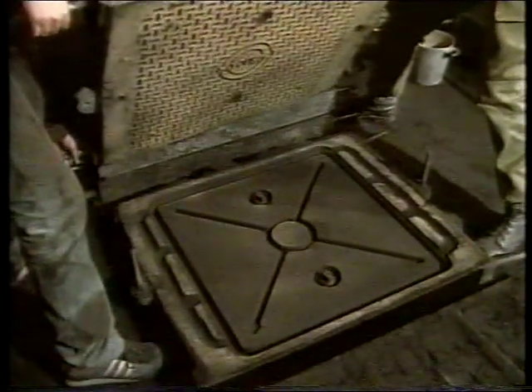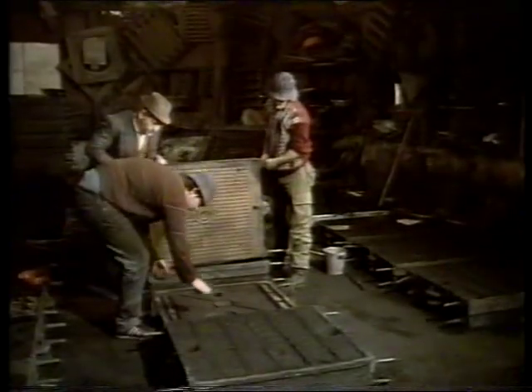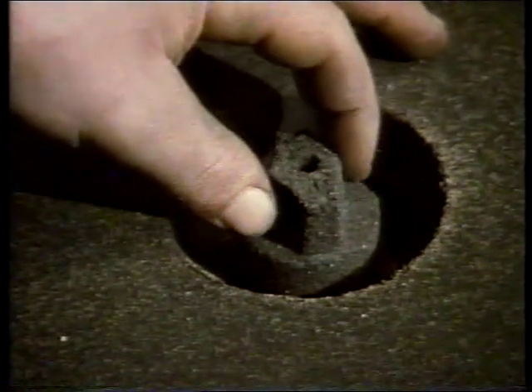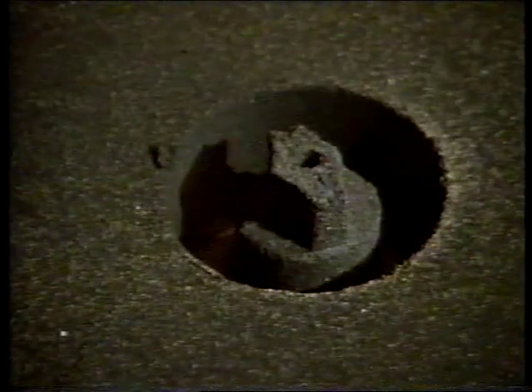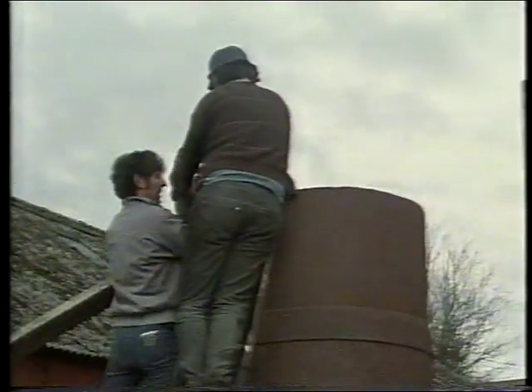The Powers make manhole covers by the hundred. These must have a reinforcing plate of steel underneath the core, so that when the key is used to lift the cover, it won't break the casting. A large lump of cast iron, impervious to the hammer blows, is jockeyed into position.